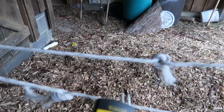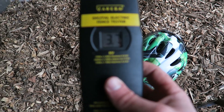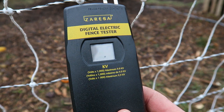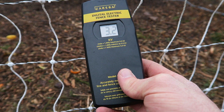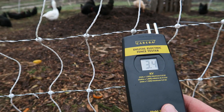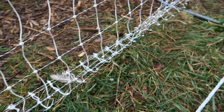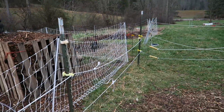So let's see if we've got heat coming down through here. Okay, we got some heat coming through. Here's what we got on the chickens — 2.6, 3.2 over here. I don't know if that's enough to scare them off. We'll see. It's grounding out in a lot of places, and it's wet, so naturally it's going to ground out a little bit more and therefore not hit as hard.